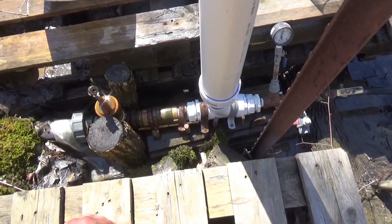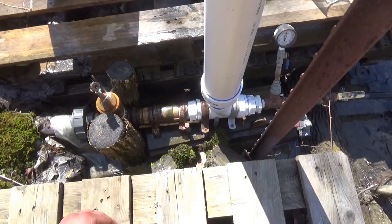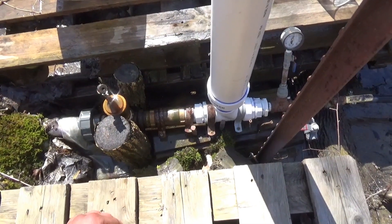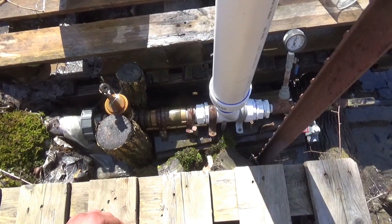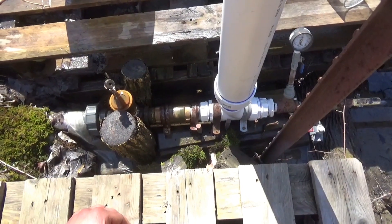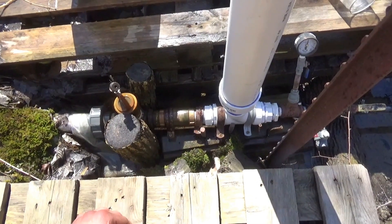This particular ram pump system uses six and a half feet of drop. From the pump to where it is delivered, it's about 72 vertical feet and about 880 feet distant. This pump produces somewhere around a gallon a minute, so we can produce about 1,440 gallons a day of spring water delivered up top to the farm — for no power input, no gas, no electric, no solar panels, no batteries. This is one of the few systems that is completely EMP proof.